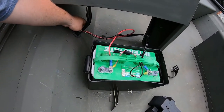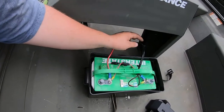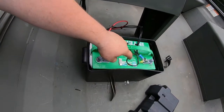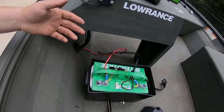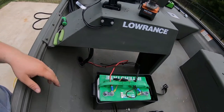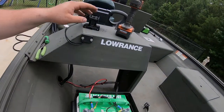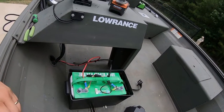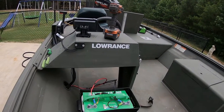What I've done is run my power wires down through here, my transducer, put my extra cord in here, and run my power wire up through here. I soldered this connection right here, and I got some ring terminals — I didn't show those earlier. I didn't realize I was going to hook it to my trolling motor battery. I planned on finding a power and a ground up under my box, but it was just as easy to run it here to this trolling battery. That way I can keep an eye on my voltage on my trolling motor battery. I've got a voltage gauge on the cranking battery.